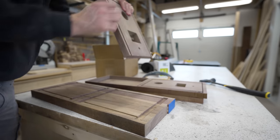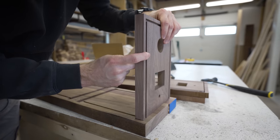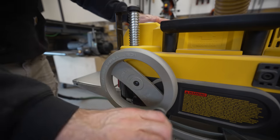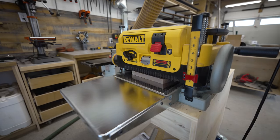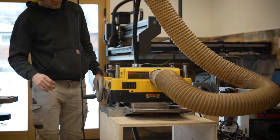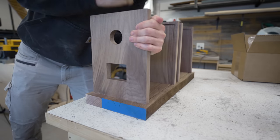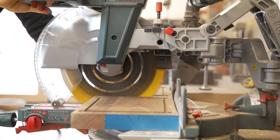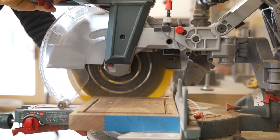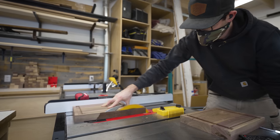As you can see, these pieces didn't really fit together, and that's because trying to cut the thickness of a piece of wood on a CNC is a huge waste of time. So in order to make everything work, I used my planer to sneak up on the exact thickness that I need. Similarly, it's also a huge waste of time to do simple straight cuts on the CNC, so I separated and then trimmed down the sides of my new base pieces using my miter saw and table saw.